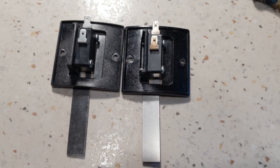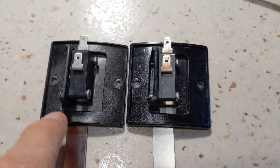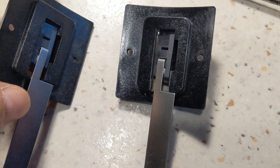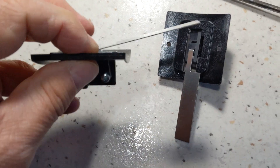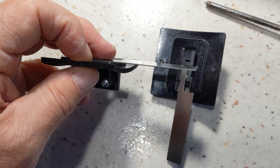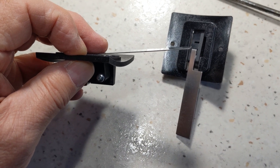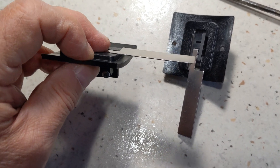There's the switches installed into the brackets — the old switch. New switch on the left. Flip them over. So when the switch actuates, it doesn't take much to make these things go. See, that comes all the way down there now. Before it just couldn't quite hit it because that raised area was here — so sometimes it would work, sometimes it was just on the edge there.